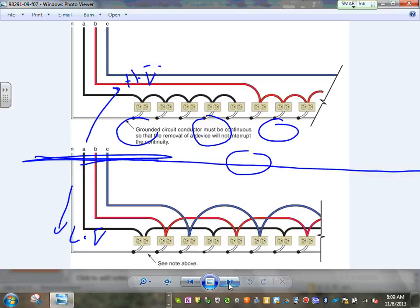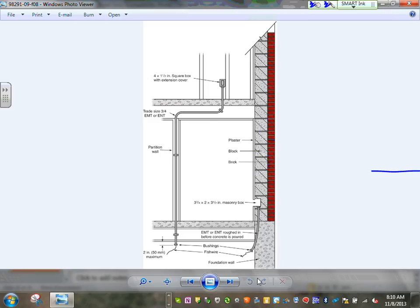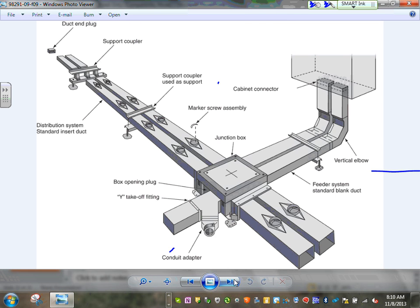Okay, so we got these guys, the wiring. For your conduits, guys, when you wire to the communication, look at that, they have a wire here inside the conduit that can pull a service conductor all the way up to the location of that cable TV or telecommunication. So it allows you to pull your low voltage. We talked about these guys, different types. Look how you can come directly with a two-duct system, guys, to get your high voltage, low voltage,